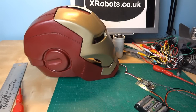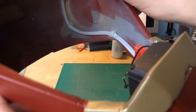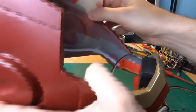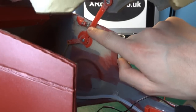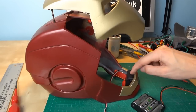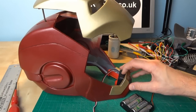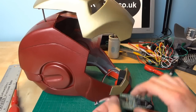What you'll notice when it's open is that you can basically constantly hear the servo trying to hold its position — it's making a buzzing sound all the time. That's because it's pulling a string up this tube, which is quite tight, and it's also pulling against the spring to make sure the faceplate doesn't overbalance so it always comes back down. The servo needs to hold its position, so it's constantly grumbling, trying to get to the position you've told it to go to, and it's also consuming power — so I'm going to try and fix that.